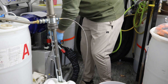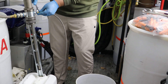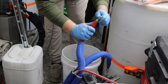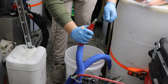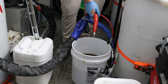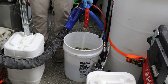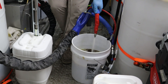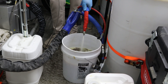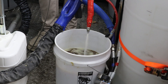Put my handle into the spray position. Make sure this is on — smooth pop off. Now I'm going to take my hose that I capped earlier from the flushing, go back into my waste bucket. I'm going to do the same thing where I suck a couple strokes of air. Now once I put it back in here, I'm going to flush the entire system until I once again hit that air pocket where it spits once or twice and goes back to fluid. That way I know I've completely flushed the entire system with the plasticizer and storing fluid.